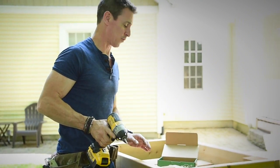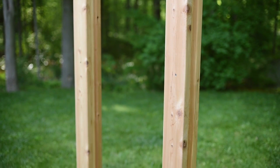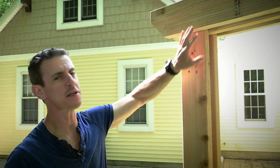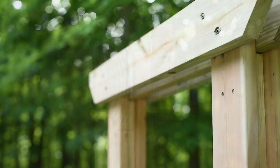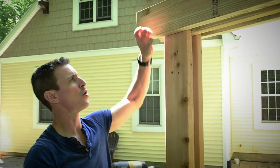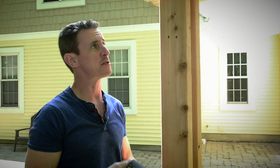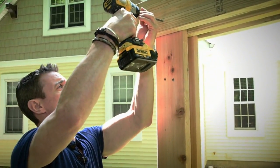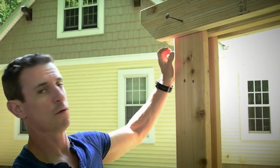That's faster than any carriage bolt I've ever installed in my life. Another great project that I love to do are pergolas or arbors. When you're talking about a pergola or an arbor, the beauty is in the details — while it's structural, it's also about the beauty. These connections are important to get stable, and normally you'd use a carriage bolt or through bolt here, which would have a big gnarly head and a cut washer on both sides. I want the wood to tell the story, not the hardware. So instead of that traditional hardware, I'm going to lock this together like it's welded with a Power Lag.